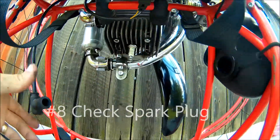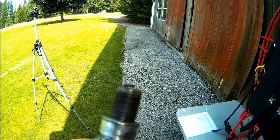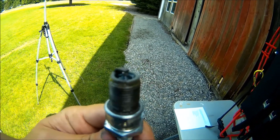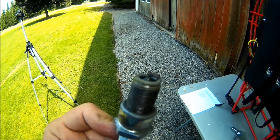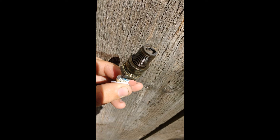So we'll pull off the spark plug and see what it looks like. You can see here that my spark plug is pretty well drenched in oil. Normally when you pull a spark plug out, you look at the color of the inside tip. If it's white or the edges of the metal are almost melting or wearing away, that's a sign of a lean mixture. If you've got a nice brown, tan, or gray color, that's a great mixture. If you have a rich mixture, you're going to have a lot of oil coated on the plug. With Fresh Breeze, because the spark plug is mounted on the bottom, you can't really tell if it's rich because it always looks rich. Just clean up the spark plug — after I cleaned it, it looks like an excellent mixture.